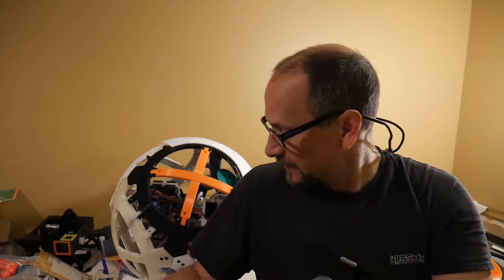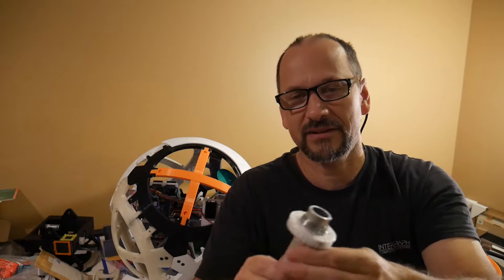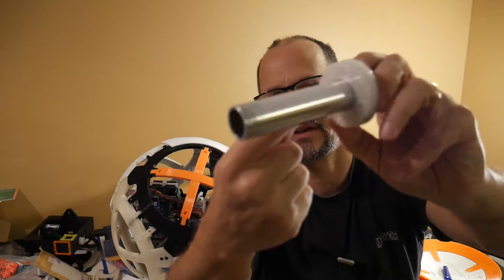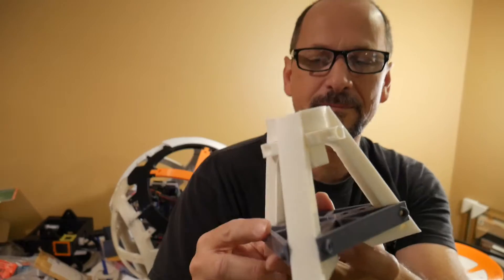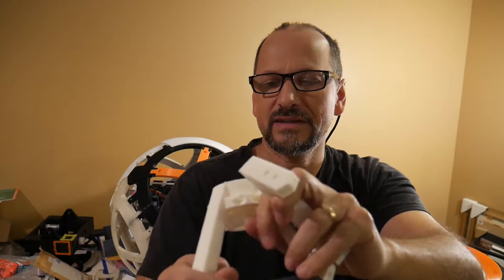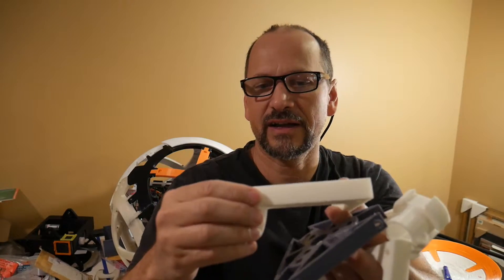Normally this has an aluminum shaft connecting in with my pulley at the end, so that's really what gets driven. The new version has set screws and little grub screws and nuts that clamp this together, so this hopefully works more or less as a monolithic piece. This is the new design — it's different in a lot of ways. It's a multi-part design, and the big reason for that is when you're 3D printing, parts are a lot stronger if they print flat on the bed, because they have a larger cross-sectional area.